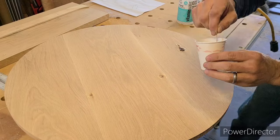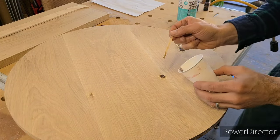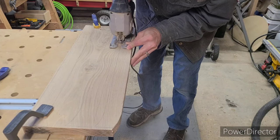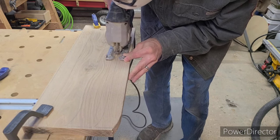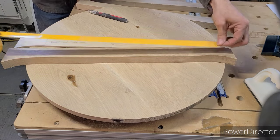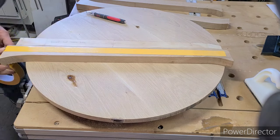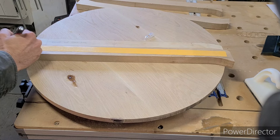Now, while this was curing, I milled down some of my inch and a half thick planks down to an inch, and those are going to be for the legs. So I made a little template for this, and I traced my three legs out on this 1-inch white oak, and I'm just rough cutting it with the jigsaw here. And then I'm going to use my template and just double-sided tape, sticking it back on. And then I'm going to use my template to clean up the edges with that same compression bit